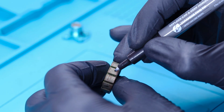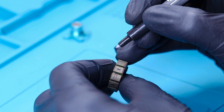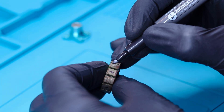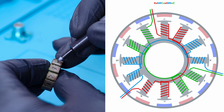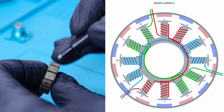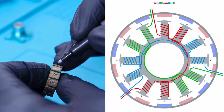You can also mark down the teeth of the stator — it will make the rewinding a lot easier. This is a 12-slot 14-magnet brushless motor. We are using the DLRK evolution winding scheme, which is one of the easiest winding patterns because it doesn't create any confusion. As you can see in the winding scheme, two wire pairs are coming out at the same slot.